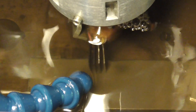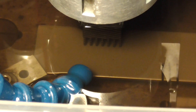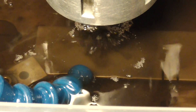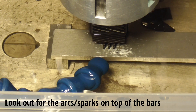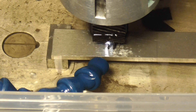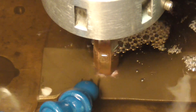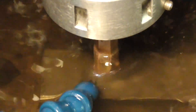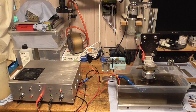Tantalum and stainless steel as electrodes welded together with the workpiece. At first the burn with graphite was the best I had with thin electrodes, but after a few minutes it was getting worse. With aluminum alloy the graphite even broke away. These burn very stable on the simple resistor-capacitor machine, although the finish is a bit coarse and electrode wear is high but acceptable.